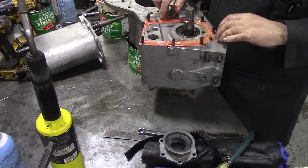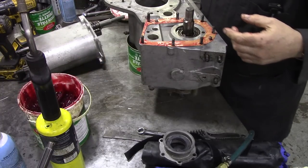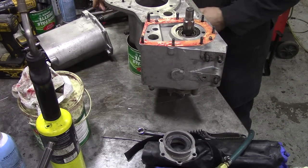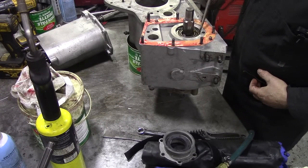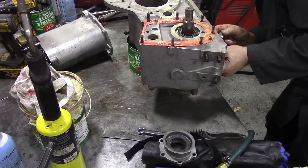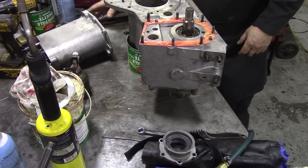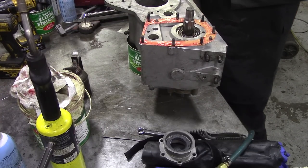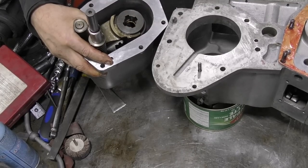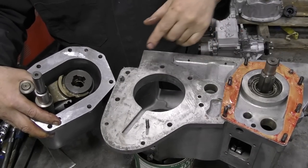Put that over there, put the top on the grease — we don't want dirt getting in there because it is kind of expensive. The next thing is to get our oil can out and give these bearings a preload with some oil. Now these are a bit of a bugger to do — you can see we've got to line that square up on the dogs here, and we've got to line that onto there with this shaft and this shaft at the same time.